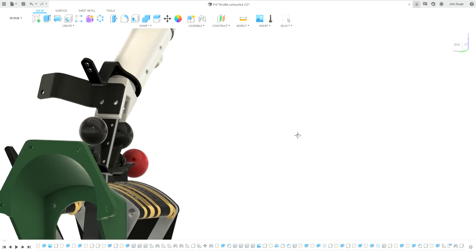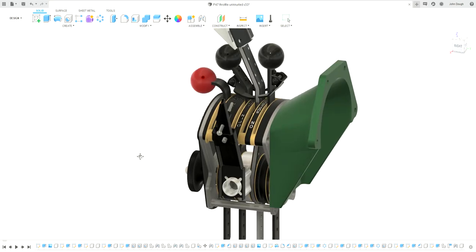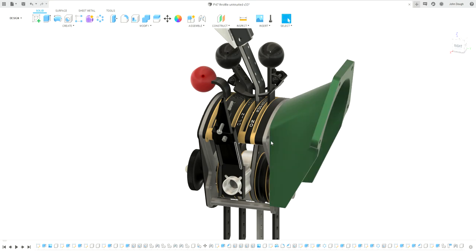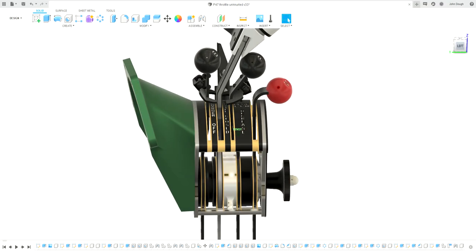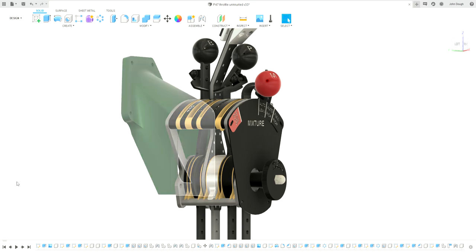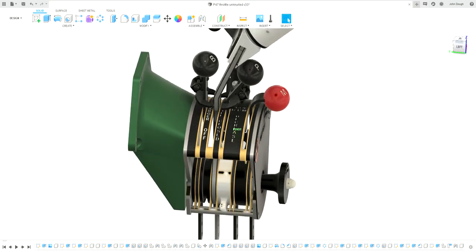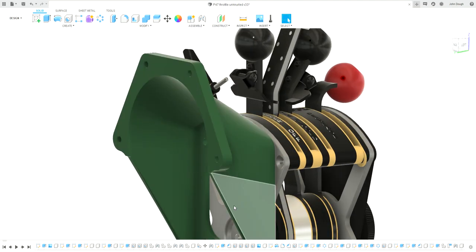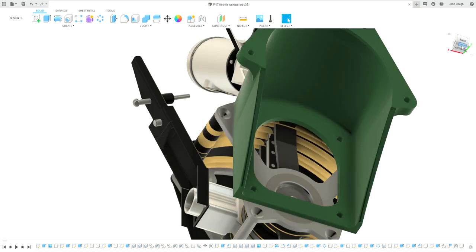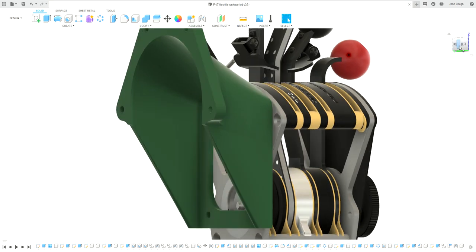For the mount, the original has a crazy angle on it which would be totally impractical for a desktop version. I did try to make the original mount but hadn't quite got it right — you can see it's got a weird angle so it fits on the body. The rationalized one is dead straight. Whether I 3D print it or machine it from aluminium — the original was a very fine thin casting. These plates are just thick aluminium cover plates; the real structure is in the frames.